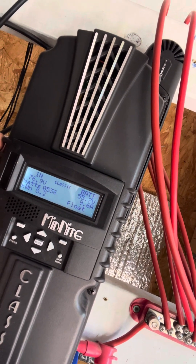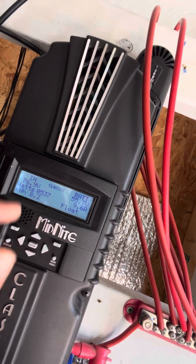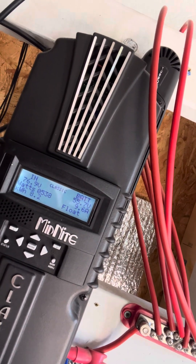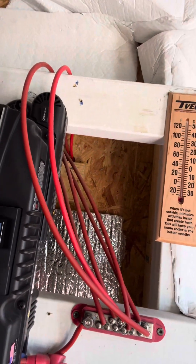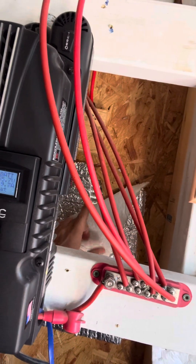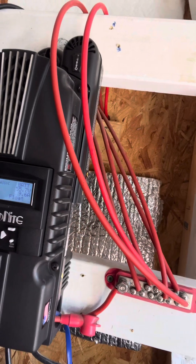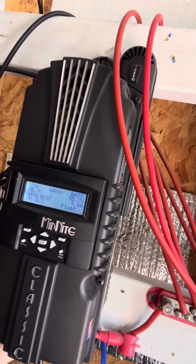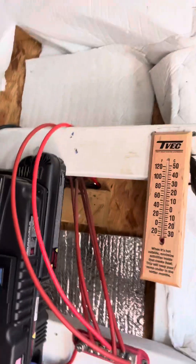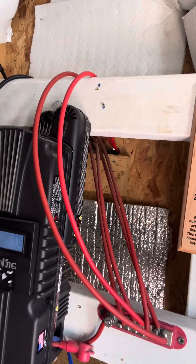This unit does have an internal fan — if it gets really hot or you're pulling in high amperage, the fan kicks on. Earlier today we were pulling in 39 amps while still in bulk mode and I noticed the fan was running. It is February here so it's fairly cool. I have soffit vents covered up behind it in winter, but in the summertime I take those off to let air in and help keep everything cooler. I have a vent here and a vent up there to allow air circulation.